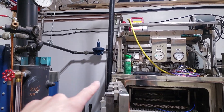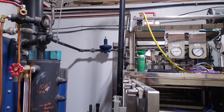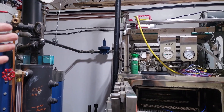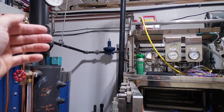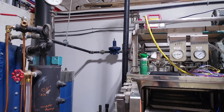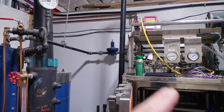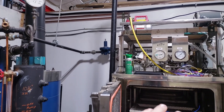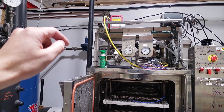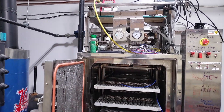One of the major issues is that regulator. It's a direct-operating regulator — basically there's a diaphragm, and when the pressure is below a certain amount, the spring lets pressure go to the other side. The downside is it doesn't allow the volume I need. If the chamber is at 14 psi and I need 15 with 30 on the supply side, it'll be barely cracked open when it should be fully wide open pushing all the steam in.